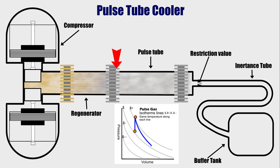This side of the pulse tube is called the cold end because it's the coldest side of the pulse tube. The other side is called the hot end, and here's why. As our ambient temperature high-pressure pulse gas travels to the other side of the pulse tube, it will compress the tube gas that's already there, causing it to heat up at that end — hence the hot end. A heat exchanger at the hot end of the pulse tube will once again remove most of the heat from the tube gas.